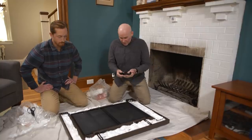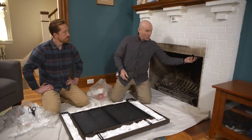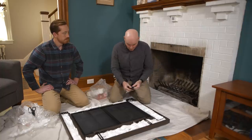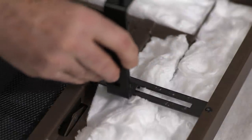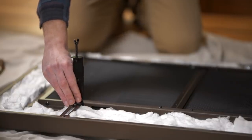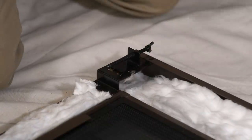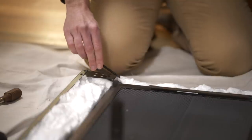The next thing are these clamps — this is just a T-clamp. It's going to go through our lintel. We're going to back screw it and it'll keep the door tight. All we do for install is we just put them in vertically and give it a twist — and that's it. You just locked it in horizontally. Now we're going to take the bottom clamp, slide it right into its bracket, lay it flat, and that's how that pressure point will clamp right into the brick.